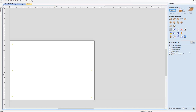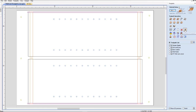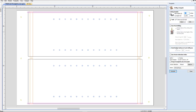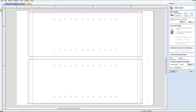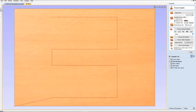It's saying that we could not recalculate all our paths. Let's look at all our layers back on here. F to fit. We calculate again. It says 'please check the data for the following.' Right here — our shelf pins. Double click here — it's going to say 'no vectors selected.' So we're going to have to go back and reselect. If something happens like this, then you're going to have to do what I'm doing right now. We're going to go with the shelf pin right here first. That's why we have those layers. Select here again — and sometimes if it doesn't recalculate and gives errors, you have to manually go back and select them again. So that's done.